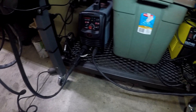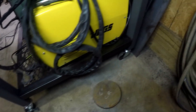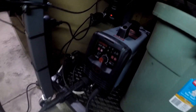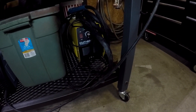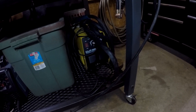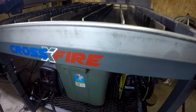I didn't have any storage anywhere to put anything, so I built this shelf. It was super simple — I used one-and-a-half by one-and-a-half inch angle iron, measured the inside diameter, and then used a piece of expanded metal. Even if you had to buy it, it's not that expensive. Welded everything up, drilled through the stands, put a couple three-eighths bolts through on all four corners. Now I'm able to hold all my stuff — I've got my Viper Cut 30 sitting on there, also my Cut 40, which I use to cut extra pieces off from the skeletons. Just be careful, because you don't want to be cutting on the actual table with a high-frequency plasma cutter — you'll fry all your circuitry.